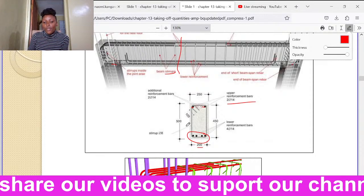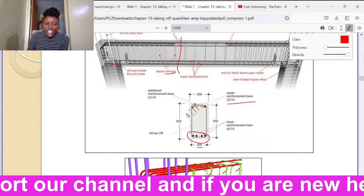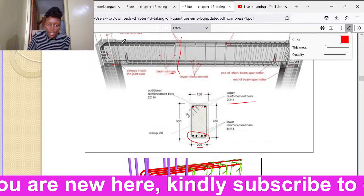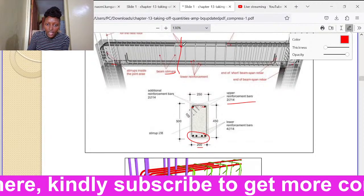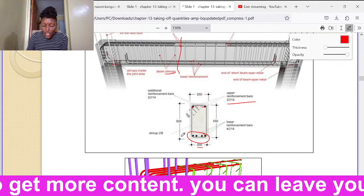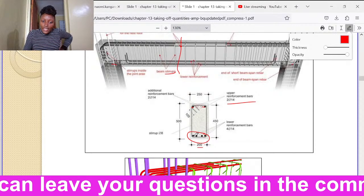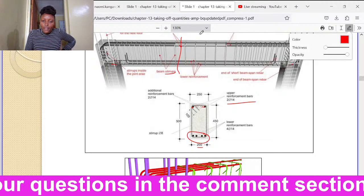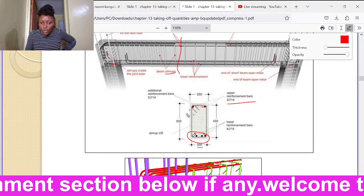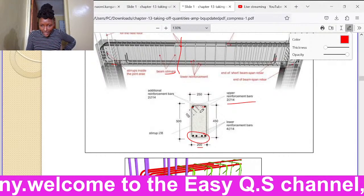So what we are seeing from the front is a reinforcement bar running away. This one, we can see it from the end. It's running this way across the beam, but we are viewing it from here, from the front. Then we have the ones below here. We can see there are four. We are viewing it from below here, as in from across here, it's a section. So we can see that there are four bars below, then there are two bars above, then they have a stirrup wrap tying them together.